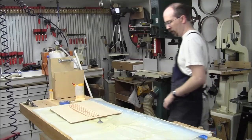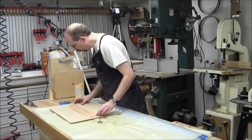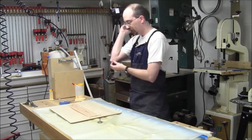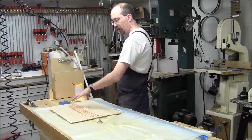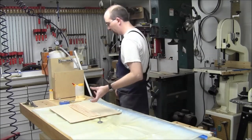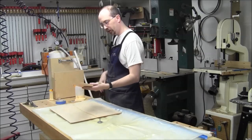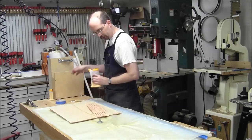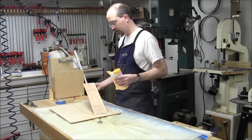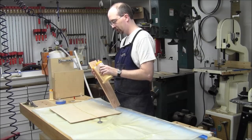Okay, we have our vacuum bag ready again. I've made a few marks on getting this positioned. When I do this with the real pieces, I'll have a slightly better system for keeping things where they go. I may actually make up a locating jig that'll use those little holes that are poked into these. So I'm going to throw a little glue on, a little tape to hold it before it slides into the bag. So we'll real quickly push things together. I haven't really done anything to the surface. I'm deliberately not putting anything on the surface because I want to see how well the CNC's attempt did.